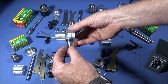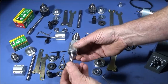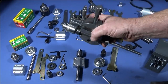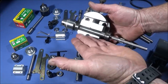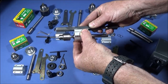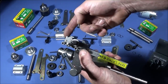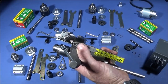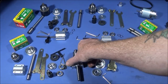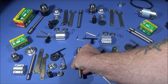That bar would be held in the vise on the tool post of the lathe and used as a tool post drill — just like my existing one, where you put a power drill on the back to drive the spindle and wind the lathe in for side drilling nice and square. Also, if you watch my tool post drill videos, you can put a piece of long mild steel bar about 12 millimeter square, bolted on and held directly in the quick change tool post on the Myford or Chinese mini lathe. I'm going to make a micro tool post drill using the 0 to 3 millimeter JT0 chuck — it'll be absolutely brilliant for that.